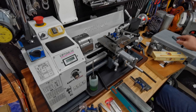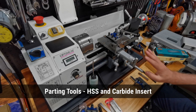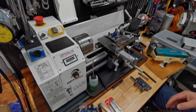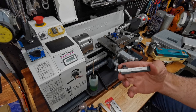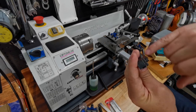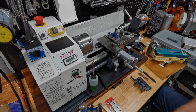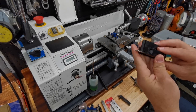The last thing with tools is parting — this is a huge problem especially on a mini lathe. I left in the parting failures in my videos because I think it's important to show. My first parting tool was this one here — and it's a terrible parting tool. This little clamp on top is just screwed down, you basically push your finger against it — there's very little rigidity. I think it's garbage. I would not buy that again, and that's the one I've had the most trouble with.